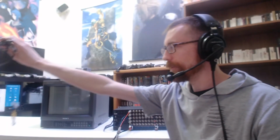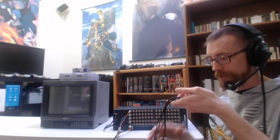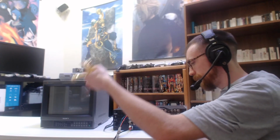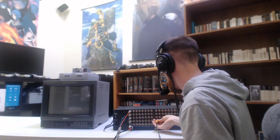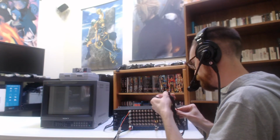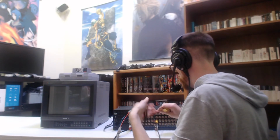I mentioned in the last video as well that you can make your own BNC cables. So what I did was I took 4 yellow RCA cables because I had them, and I attached little RCA to BNC adapters on both ends of it, and then that way I can use that as an output to my PVM from the back of this matrix switcher. So you just attach these cables like you would any other normal BNC cable, and just run your video that way.